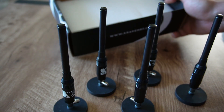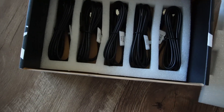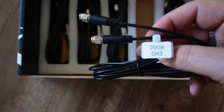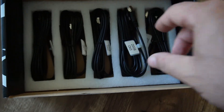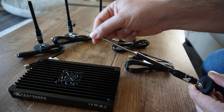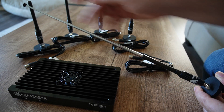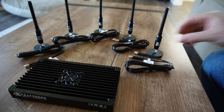Here the antennas are shown in their collapsed state. Removing the foam reveals five neatly packaged SMA male-to-male coaxial cables — one for each of the five channels supported by the Kraken. Each cable bears a label to ensure the appropriate antenna delivers signals to the correct channel. Since the antennas are telescopic, you can easily adjust them to the most appropriate length for your target signals, tuning anywhere from around 100 MHz fully extended to around 1 GHz when collapsed — a great deal of spectrum to cover.